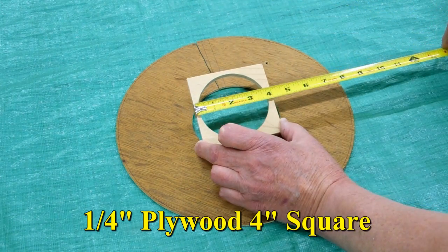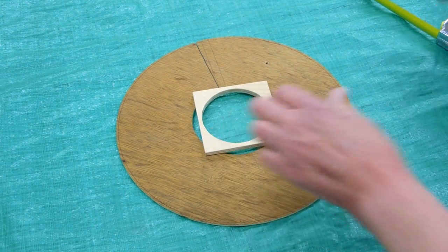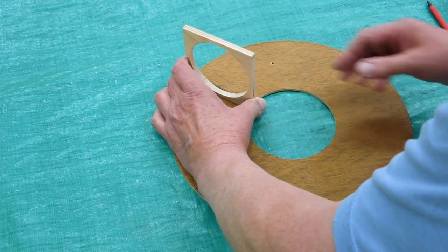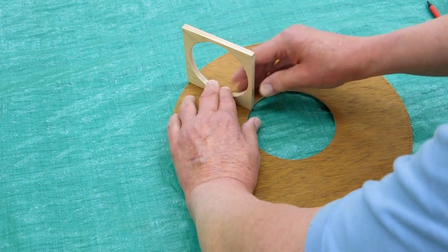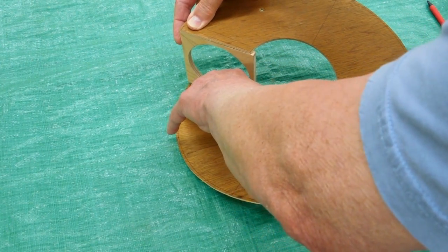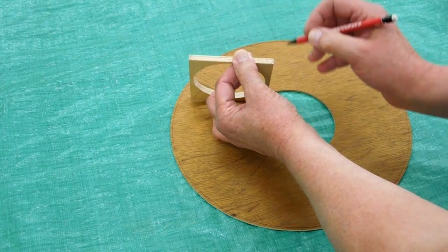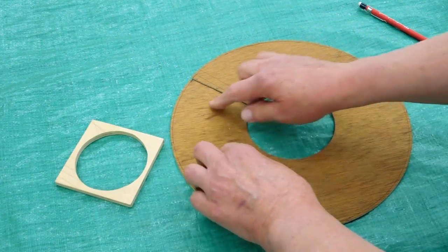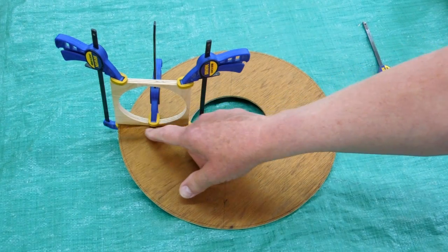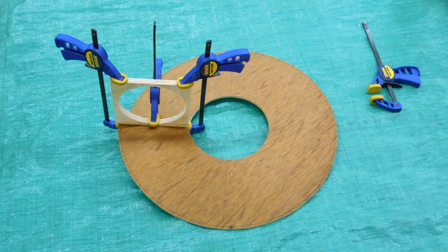Take a piece of plywood, four inches square — I'm using quarter inch here, slightly over quarter, but you can use half inch. We want to put a hole in the center so that the piece of pipe will mount in there. I'm going to glue this piece of plywood on, and when that joint is dry, I'll bring this piece up and glue it on top, clamping until dry. I'm going to sand a little bit of an angle — one or two degrees — to go along with the angle that this ramp will create. I'm gluing that with original Titebond glue, and need to make sure it's absolutely dry before bending the other piece up, because that puts the joint under quite a bit of stress.